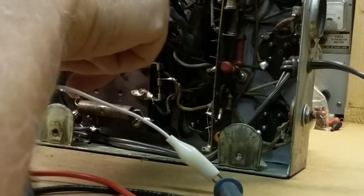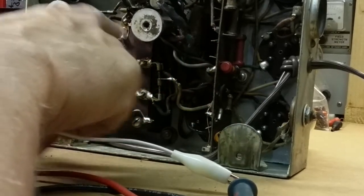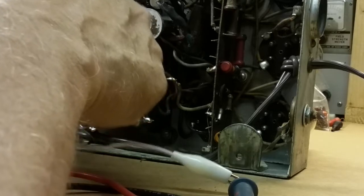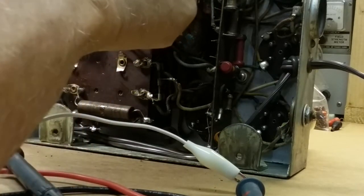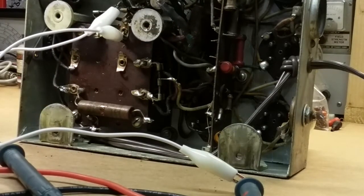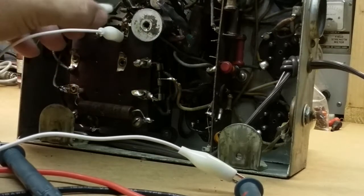Oh, there's a wire here on the center tap. See it? It goes over to here. If this wire is going to a coil and this wire here is going to a coil, then yes, we would be reading across the coil and not the resistor, just like reading across this. That remains to be seen. Let's go from this side, which is the damaged area, to the center and see if we get some kind of a reading. If that's the case, what I just mentioned, then we won't get anything valuable here either. And then with the same problem, 0.2 ohms, which is probably a dead short.